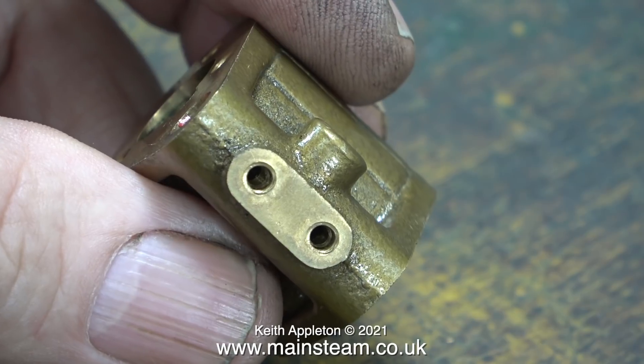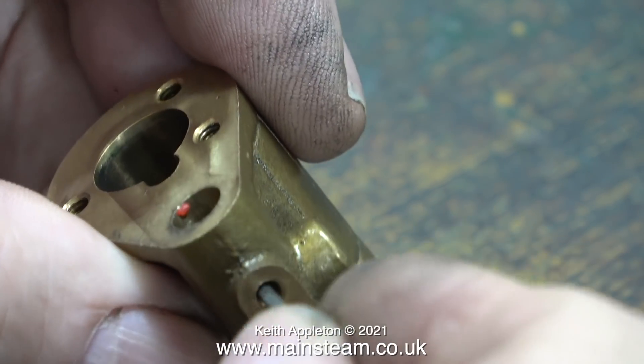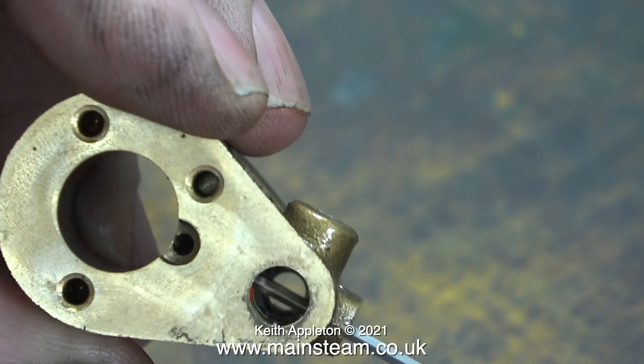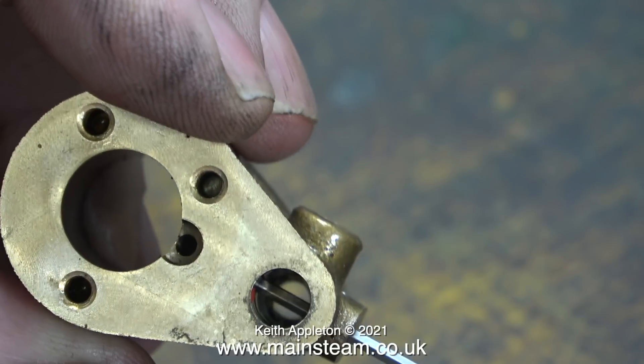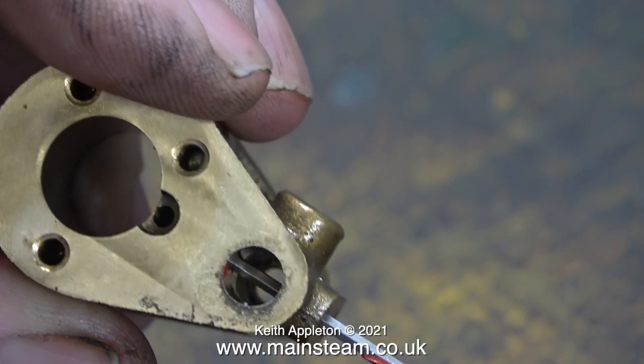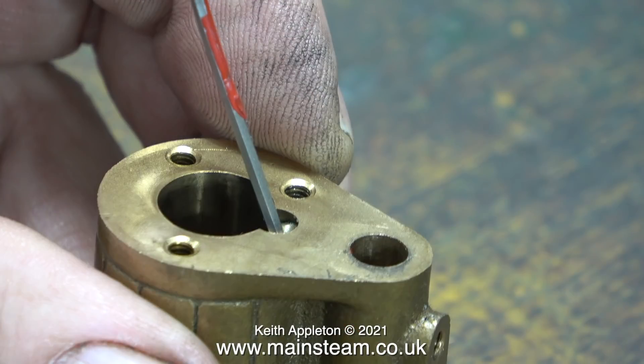Taking a close look at the cylinder, you can see why these holes were drilled to take blanking plugs. When I push an Allen key through the holes it goes into a hole at the other side of the piston valve port. You can see that quite clearly in this image, and you can also see that the hole from the edge of the cylinder is drilled at an angle, pretty much like it would be on a standard slide valve port.